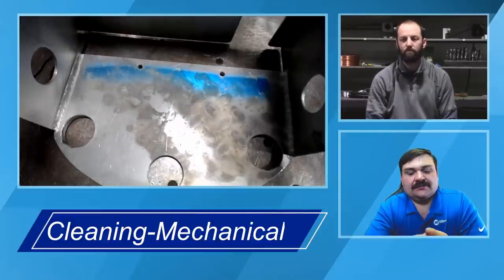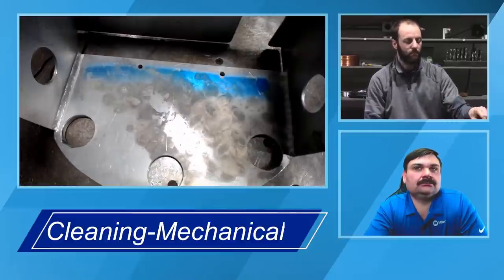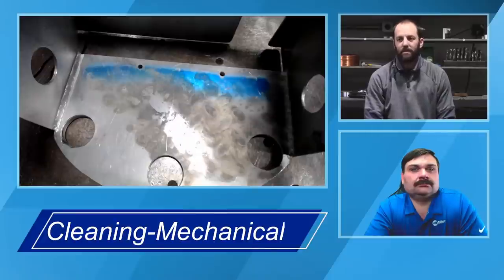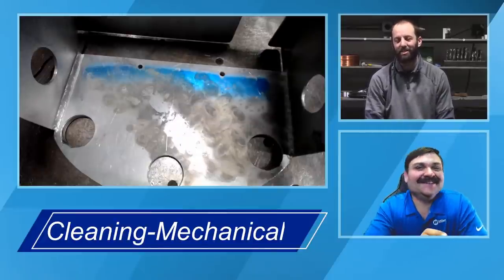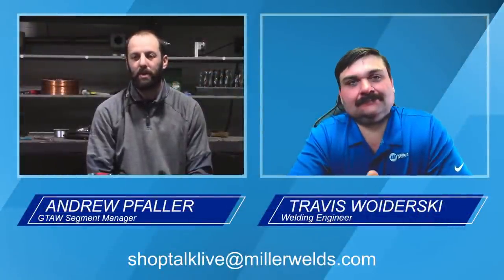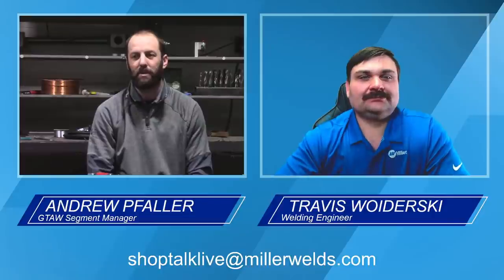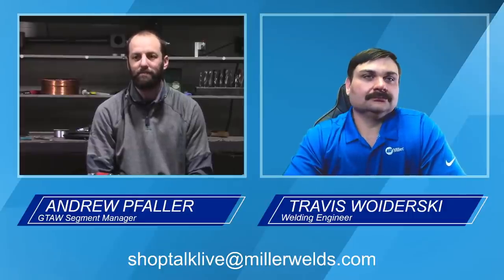We did have one more question. Go ahead, James. Is it okay to use a stainless steel wire wheel and a drill to keep the speed down? That's okay if you're careful. A lot of it has to do with the pressure. I'm not going to say that you can't get good results. It certainly wouldn't be my preferred method because you have a little bit less control and a little bit less feel on how much pressure you're actually applying in that process.